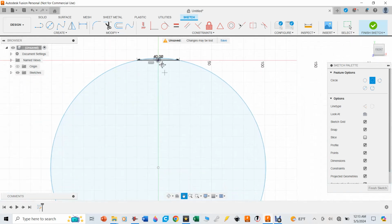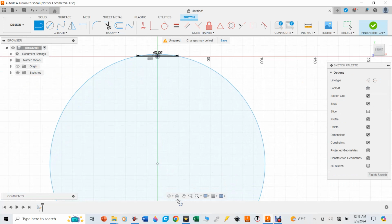I'm going to scroll out until I can find the origin of that. I'm going to hit hotkey L, click on the center of that, and now we can see that the radius it made is 101 inches. So I'll write that number down because I'm going to need to put that into the die library in Bend-Tech.